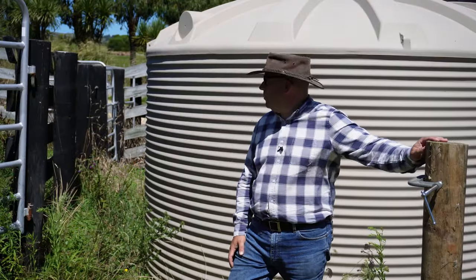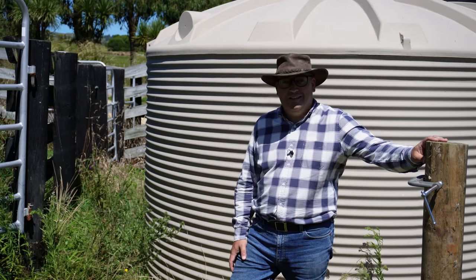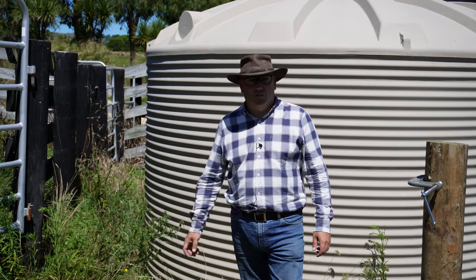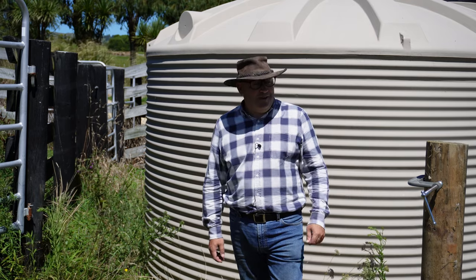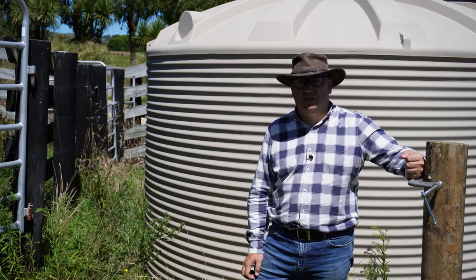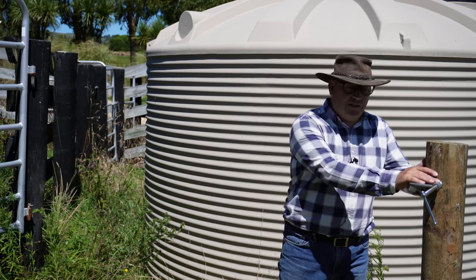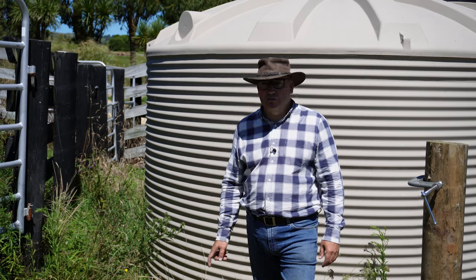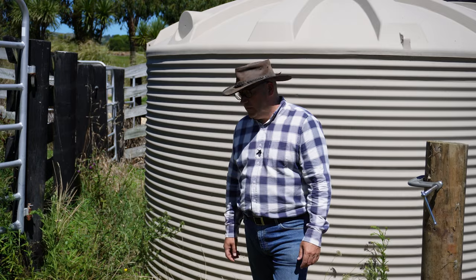The post is in the ground — that's exactly where we need it to be. We need to measure now to make sure that this is exactly the 2.4 metres that we planned. If you've got a second pair of hands, this certainly makes it a lot easier, one at each end. But if you're doing it on your own, a great idea is to put a G-clamp here horizontally — it just creates a really nice firm surface that you can rest something on while you're working at the other end. Even these thinner posts are pretty heavy if they're going to fall on your toe.